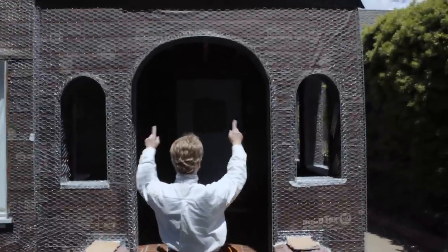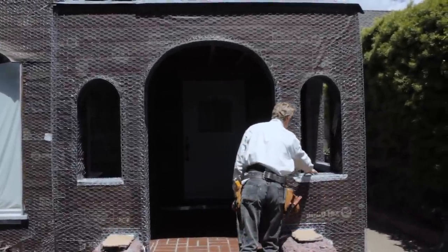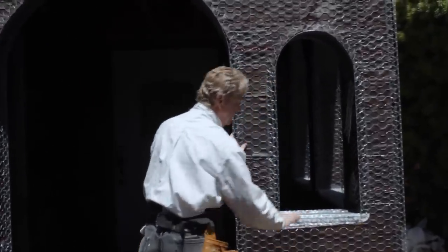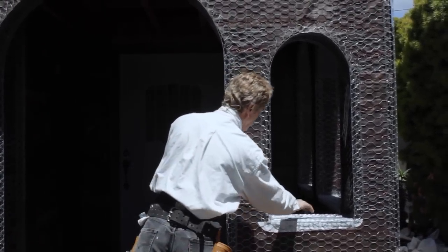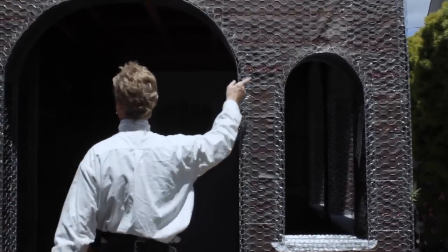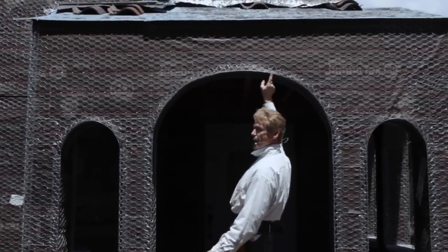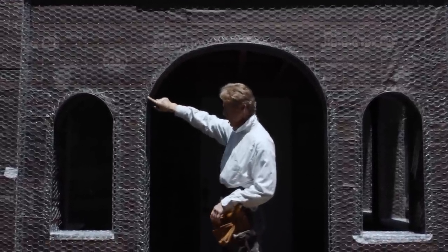The arches and the corner aids are done. The waterproofing of these solid surfaces, these are flat. So if I put paper on a flat surface, it's only a matter of time before water gets in there. You can't do that. You can put a membrane. So we showed a few separate videos of how to do these corners, because even some of the best stucco guys have a lot of problems with that.